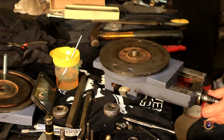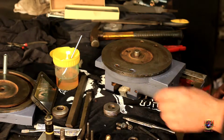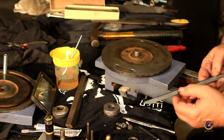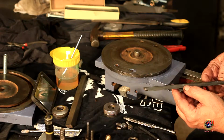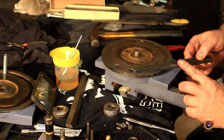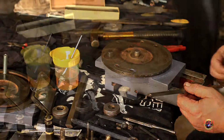And then the gib can go in with its adjustment screw. That's number 17, which is this gib right here. And it goes in like so. You know what? I'm going to rub that on the India stone and get any edges on it. I feel a couple burrs right here on the edge. So let me do that, and then we'll be back.